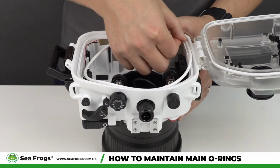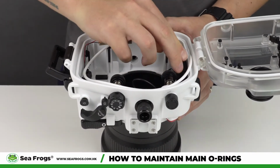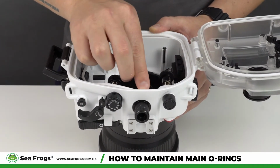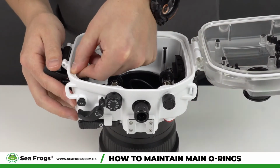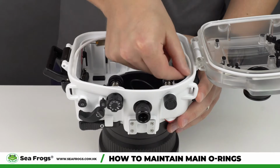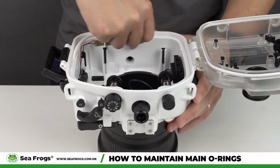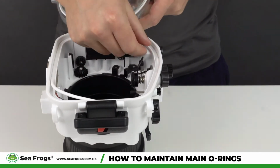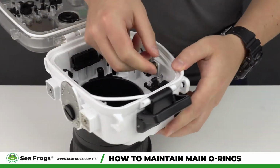To install it, first what you want to do is do this kind of motion. Essentially, you skipping a bit of distance each time and then you're pushing the O-ring into the groove. Okay, now we see there's not enough. So what we do, we take it a little bit out and then we slide it over. We're pushing it and we're sliding it over inside the groove. So this kind of waves pattern, we're gonna slide it over so the O-ring can travel into a different direction.